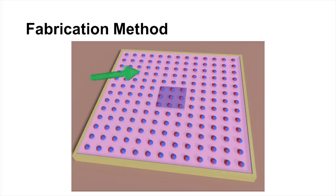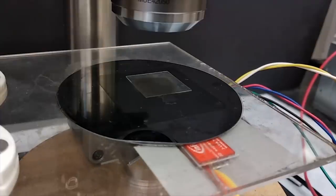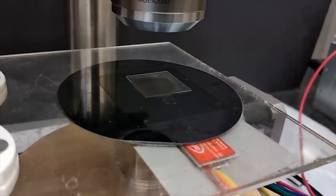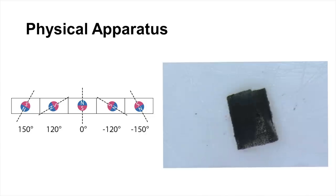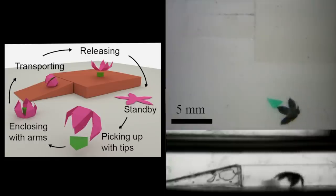Then the magnetic field can be adjusted and the next section cured. Ultimately the result is a flexible device with embedded magnets that have different orientations depending on where they are. This pattern of orientations is what gives these micro robots their unique behavior in response to magnetic fields. If you point multiple compass needles in opposite directions within a flexible device and apply the field vertically, those compass needles will both try to orient and align with that applied field. With the right magnetic fields, the results can be pretty sophisticated.